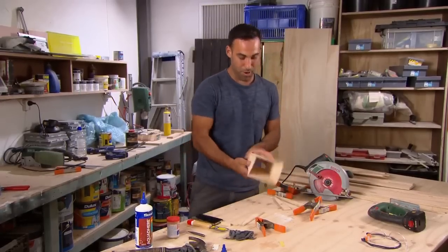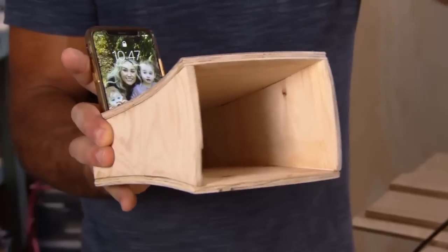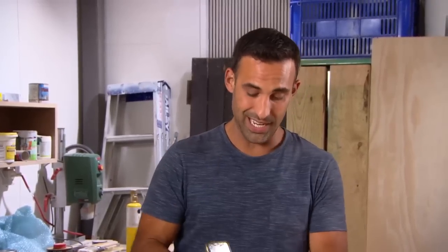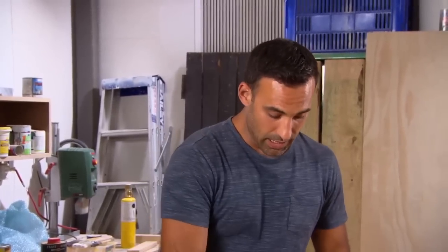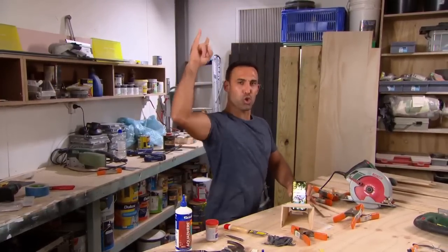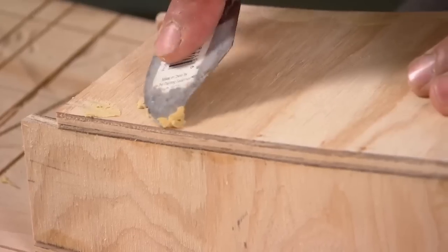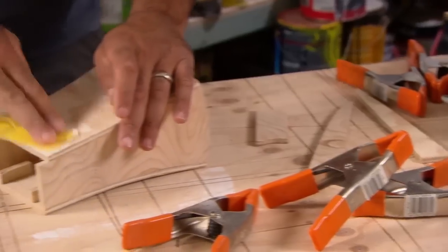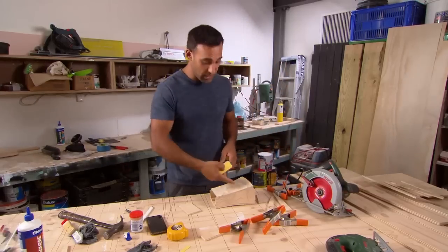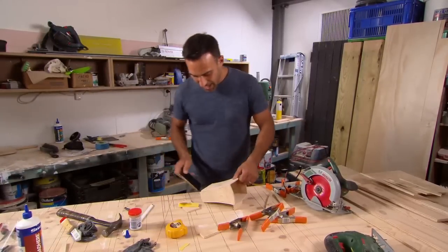You can see what the box looks like — it's like an old retro speaker. The phone sits in the back and the sound blasts out from the front. Most phones have speakers down the bottom, so I need to add a couple of feet to raise the phone — that way it just sits in there and we'll have heaps of sound. I'm filling the nail holes with some oak putty which blends in perfectly with the ply. Once the putty's dry I'm giving it a good sand and adding a stand underneath for a nice angle. I'm leaving the back off and lacquering it first so I can get into all the nooks and crannies, then stick the back on at the end.